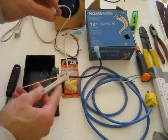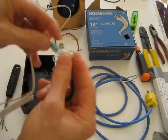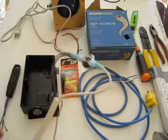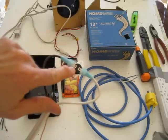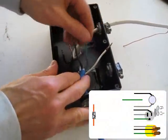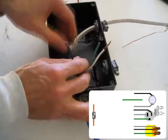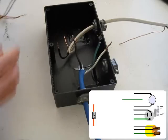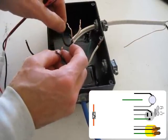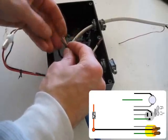Just to test — plug one end in, plug the other end in, and there's a nice firm cable for mounting inside the solar air heater. It's fairly well insulated with only a small exposed section. Now to start wiring up things inside the box. This is the extension cord going to the wall socket, and this is the wire for the snap disk controller. The fuse goes first — it goes between the hot from the extension cord and the hot going to the snap disk controller. The red wire is the wire going to the fuse.